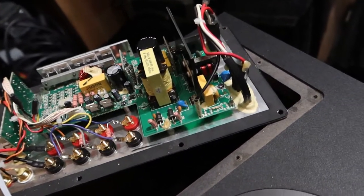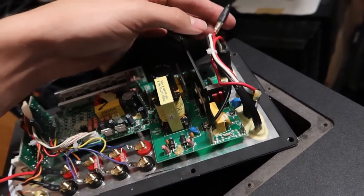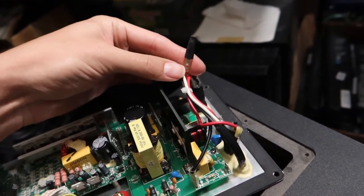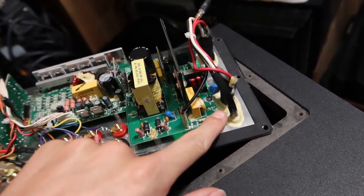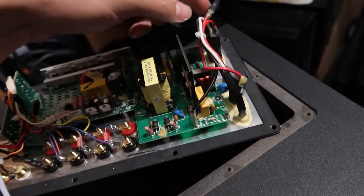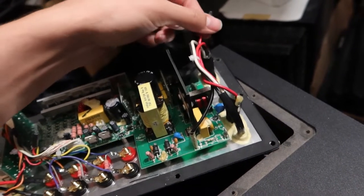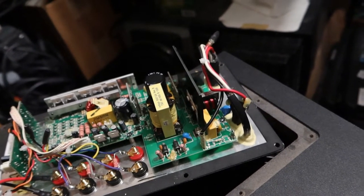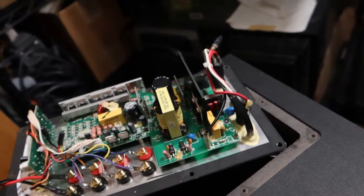The last thing I did was disconnect the input. The mains here, which normally connect there, are disconnected. I put heat shrink with a little hot glue and tucked it up inside, so if you did plug it in, nothing would happen. We'll leave the fuse in.